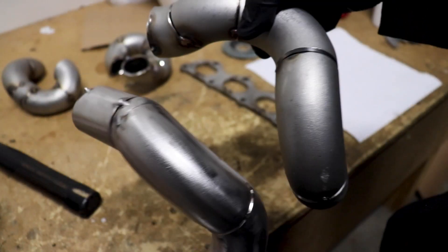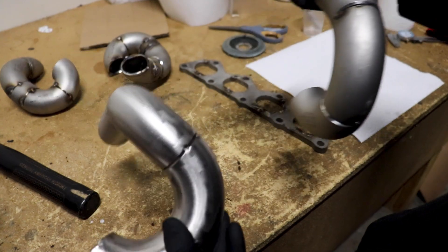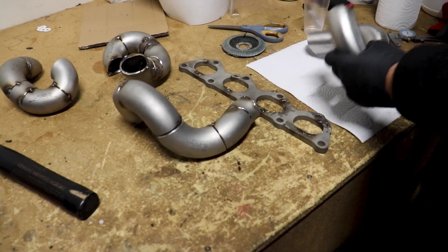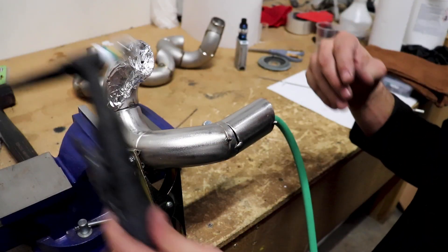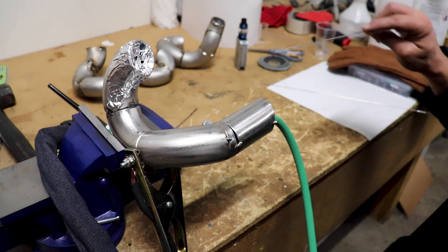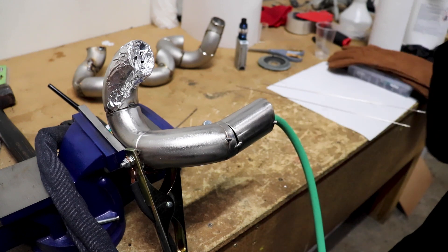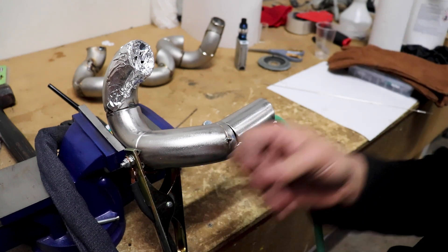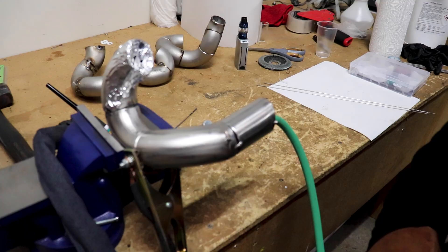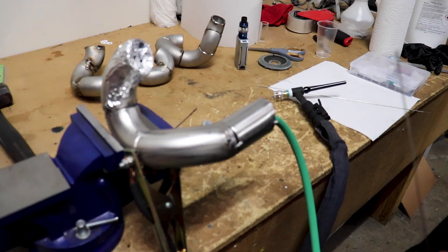Here's the difference before and after — it just kind of removes all the coating and makes it a little shiny. All right, we got the tungsten all sharpened, it's been purging for a while. I'm just going to start at these welds and make my way back. Got my little purge line hooked up, cleaned my filler rod off with a little bit of acetone, got a fresh set of clean gloves. Let's see if we can make some nice welds here.